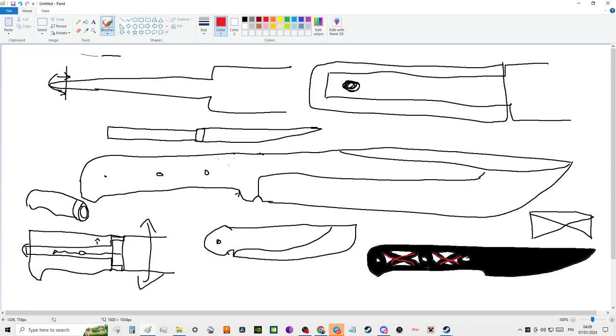Now, again, the only reason you're skeletonizing a full tang is because of weight. It's not an abuse knife. It's not a knife that you're chucking around. They will actually handle a lot, but if you look at Joe X videos and stuff like that, what's really interesting is that often the blades that survive the ultra abuse test that he does are the rat tails, because they give, they bend rather than snap. Now, there's a lot to do with heat treat and stuff like that too, but you will see that one is not stronger than the other. It really comes down to design.